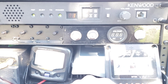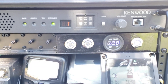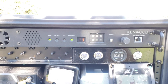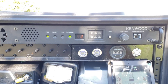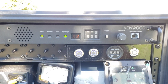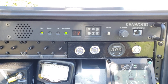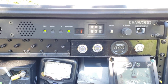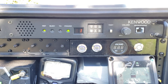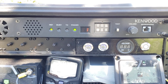I also put in a separate voltmeter — right now it's reading 12.8 volts. Right up here is the repeater: it's a Kenwood TKR-840, a 5-watt single rack-unit repeater. This repeater can have up to 23 talk groups, so you can set up 23 individual PL tones on your system. If you're building a bunker system with different families in each bunker, each family can have a different PL tone and they won't hear each other.